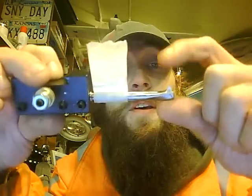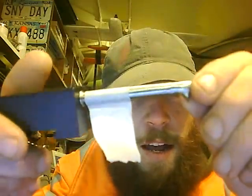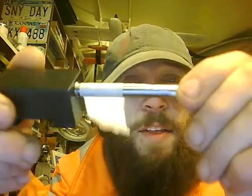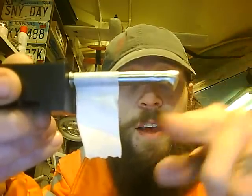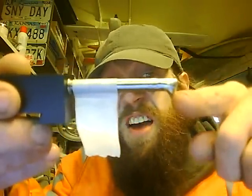The steel insert is super-duper high carbon, oil-hardened Rockwell stuff, which I ground to the 60 degrees I needed. Then — I don't know if you can see the brass — I brazed the whole thing together, ground it all down, and made it pretty.